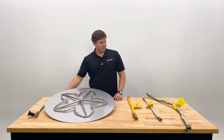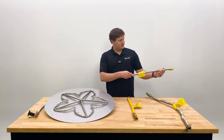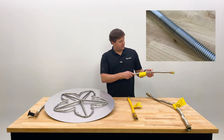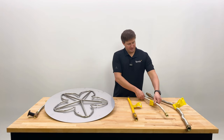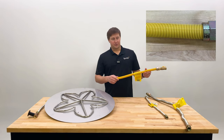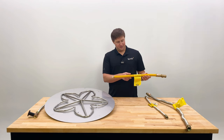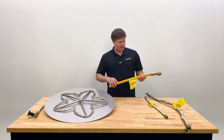The other thing is make sure you're using a whistle-free flex line. Here and here we have a whistle-free flex line. You can tell it's whistle-free because the ribbings get tighter and more spread out, which helps break up that flow a little bit, compared to what you might find at box stores — a non-whistle-free flex line where the ribbings are all standardly spaced apart, and as gas travels through those ribbings, it can create that noise.